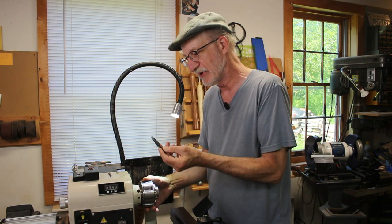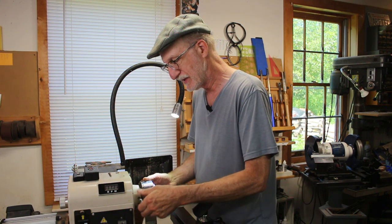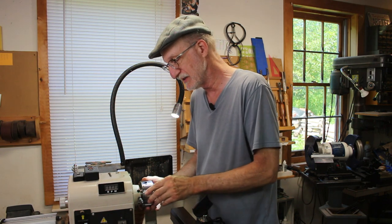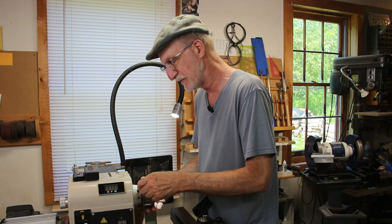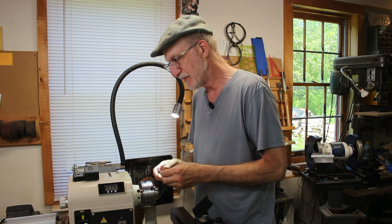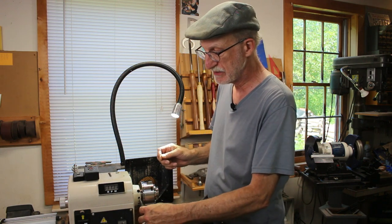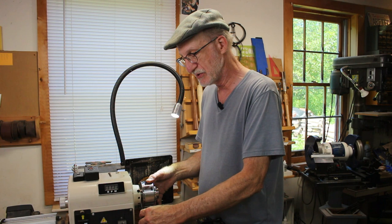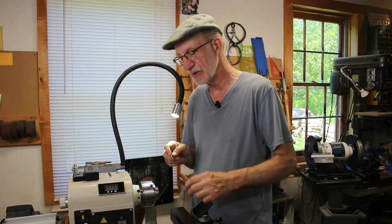This pin — I don't like it very much. It's just awkward to use. It has a threaded end that can go into a threaded hole here so that it will thread in and hold very securely once it's all the way in. There's a slight taper on the end of this bolt, if you will, and that locks the chuck really nicely. Whereas if you just use the pin and push it in, it's a little bit sloppy. What I want to do is make a nicer version of this. One difference between my machine and John's is that his pin goes in at a slight angle and tends to fall out. So I'm also going to try and put a magnet in the end so that it'll hold itself up.